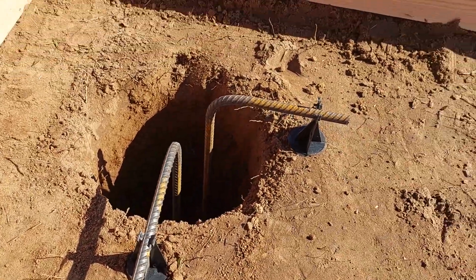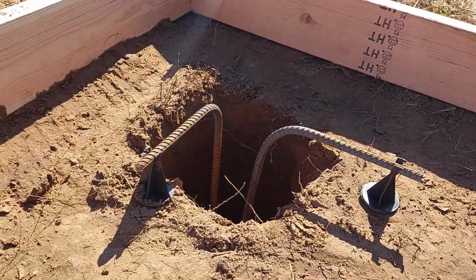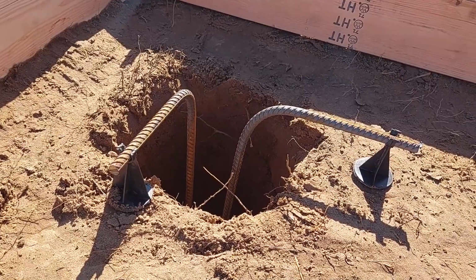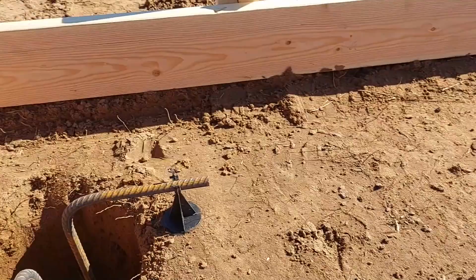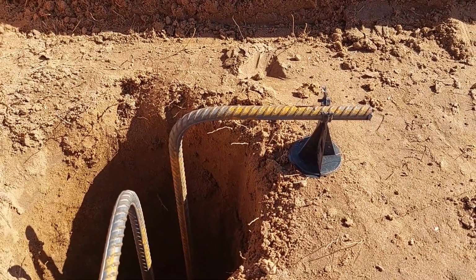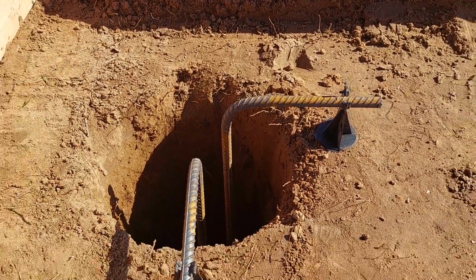There we go, just like that. I got the other one done. The first bend there on the right was done without using that 1/2 inch gas pipe slip over, so the radius is a lot looser than what I get when I use that 1/2 inch gas pipe to just keep the bend focused in that one area. Anyway, 4 more to go.